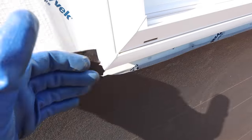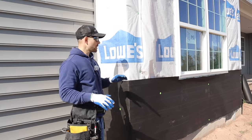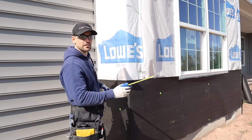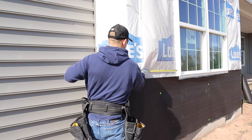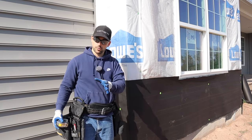Right here, when we overlap with the next layer, we're actually going to put a little bead of quad caulking here to seal it, so that when water comes down it doesn't go behind this little cut and it adds a little layer of protection. Since the felt paper comes in a big roll, I found it best to cut the felt down when you have an opportunity. I'll tuck my tape measure into this J-channel and flex it around the corner — that gives me about a 60-inch, five-foot piece.